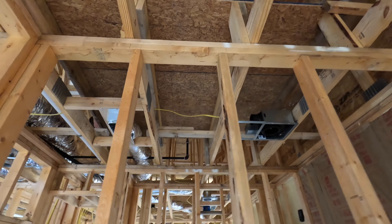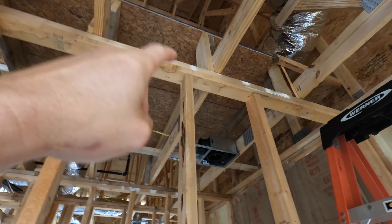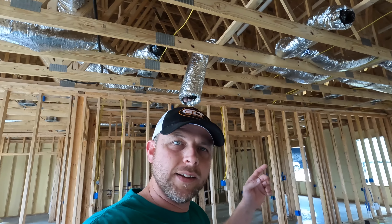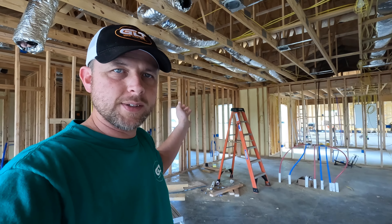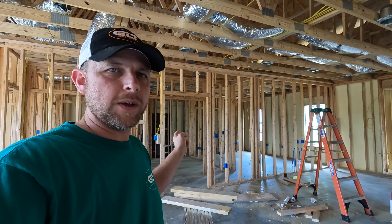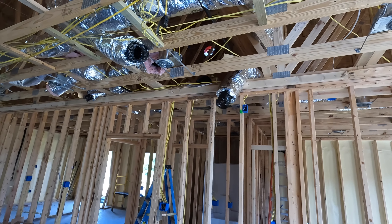Here's the reason I set these fans up in the attic and why I'm doing it this way: my heat and air guys are roughing in the duct work now — most of the drops are in and they're putting in the trunk. They've already got my air handler sitting up there on a platform I built, set about 16 inches off where my ceiling will be mounted. That way we can insulate underneath the platform and dampen some of that sound. Ideally I'd prefer to have the air handler down on the main level in 70-degree temperature, but this house isn't huge and I didn't want to take up closet space on the main level with a heat and air unit — plus there's the noise factor.